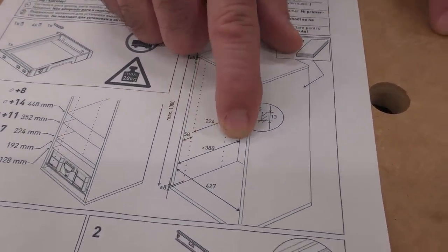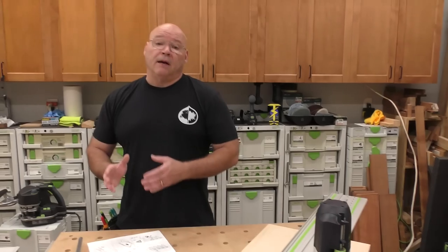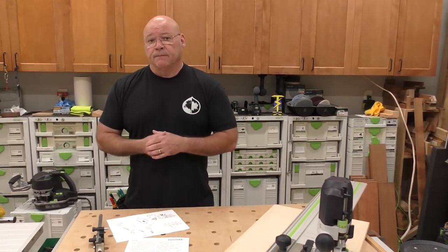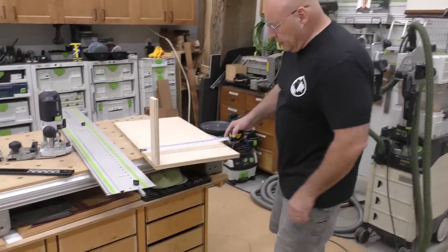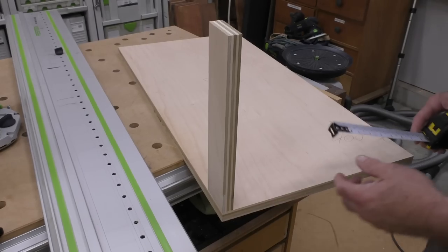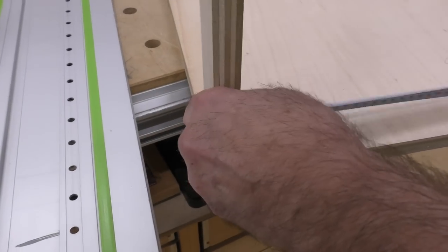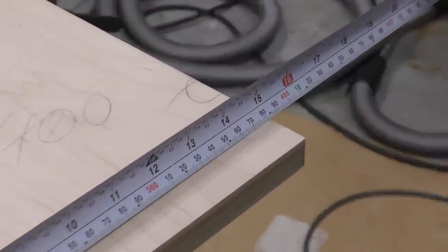The minimum width is 380 millimeters, but I've always cut mine at 400 because I have 18 millimeter nailers. The first thing I did is rip these at 400 and added a 1 millimeter edge banding. This is going to be my nailer — it's a little bit wider, but it's 18 millimeter. So when I measure for the SysAZ drawer, you're going to see it's greater than 380.